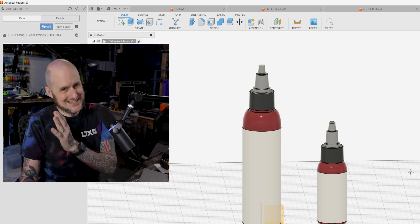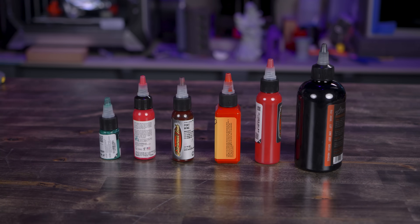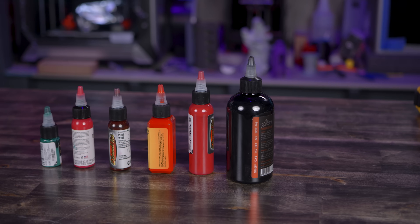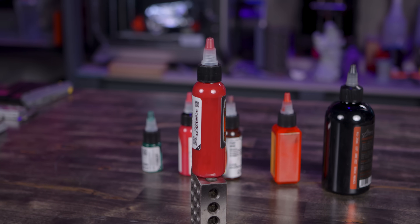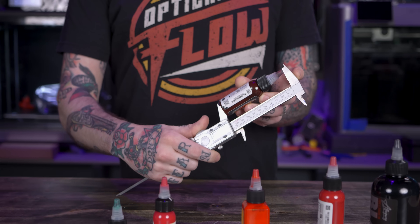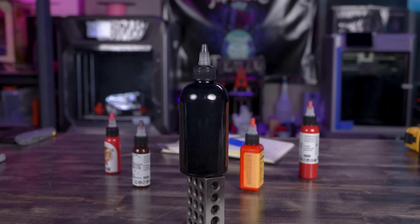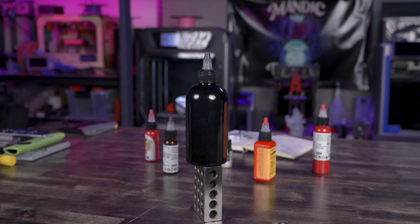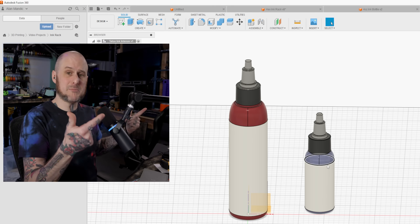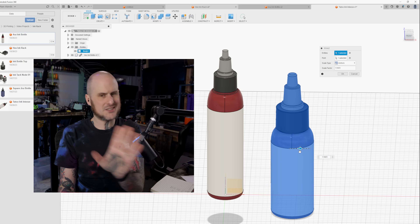The only problem is it doesn't match the dimensions of the bottle I want to design around. Four out of five bottles I'm working with have really similar diameter dimensions, so I'm going to take the largest of those four — the four ounce bottle — and design my entire system around that. Then I can make adapters or spacers to use the smaller bottles in the same system. The larger eight ounce bottle will have to be in its own thing. I'm going to show you a trick to turn this smaller bottle model into the bigger bottle without wasting time remodeling. I have the dimensions measured off the bottles written down in my notebook.